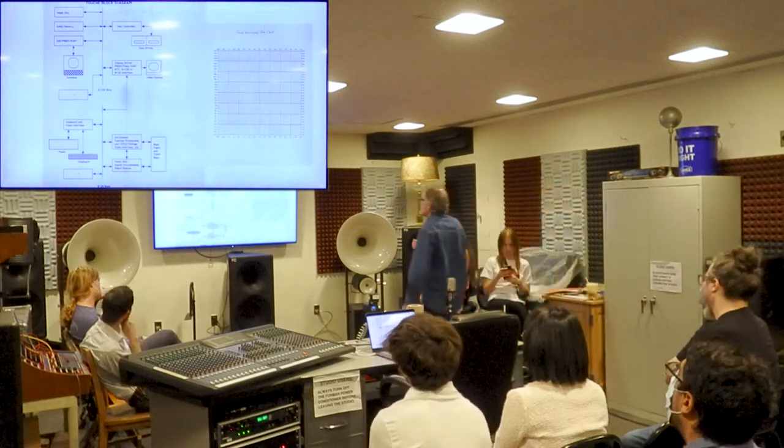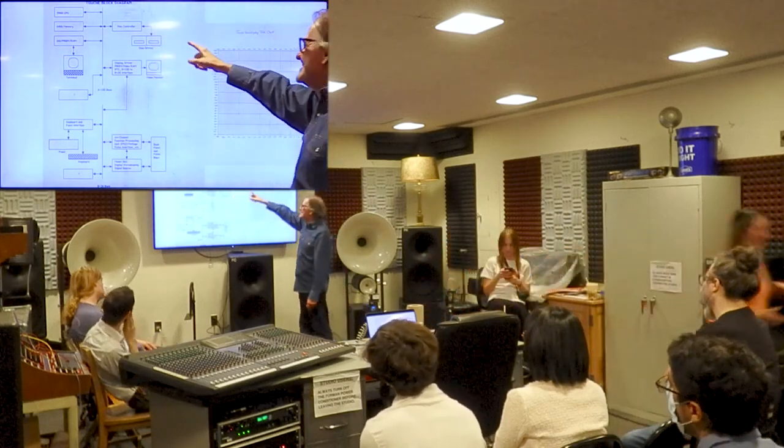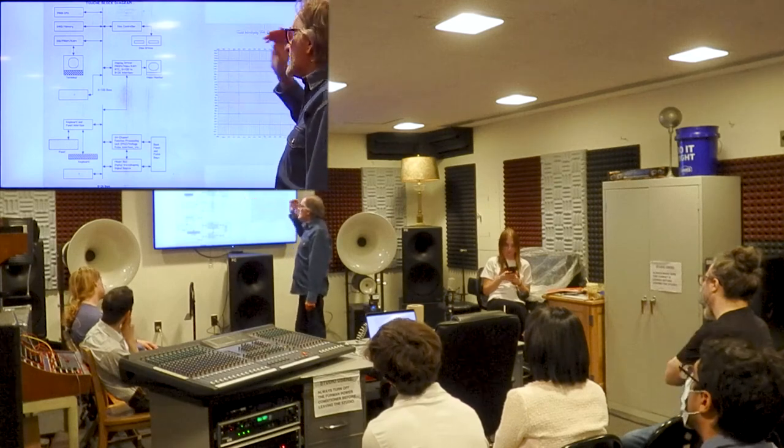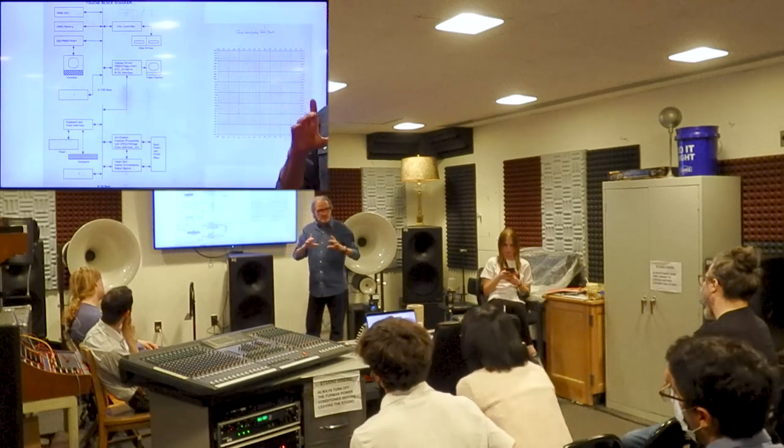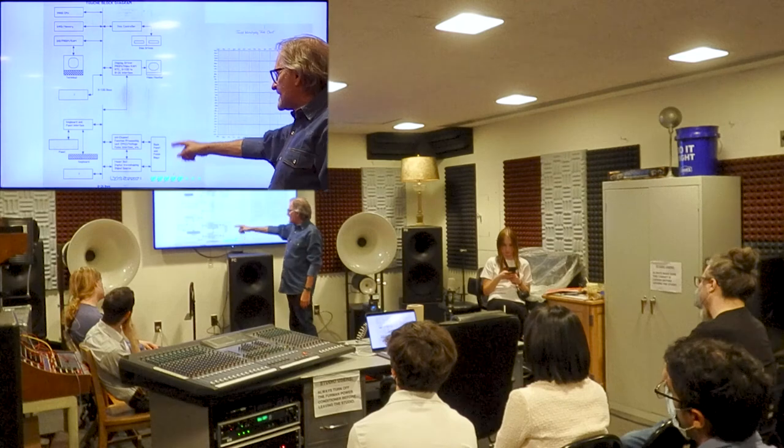And then, all right, so here's another block diagram. So it had the 9900 CPU, 64 kilobytes of memory. The basic software was stored on read-only memories. A disk controller card, if you had that. There's a display driver that would actually show you the display of the 64 channels of the MARF going up and down, so you could watch it. Any other thing you want to plug in, keyboard, panel interface, here's the 64-channel function processing unit, back panel, and so on.